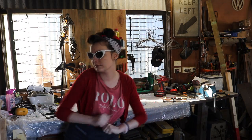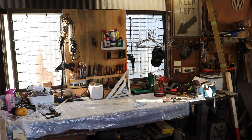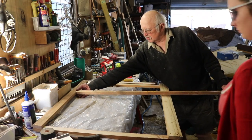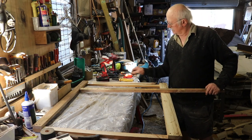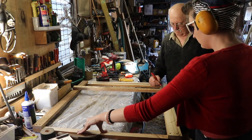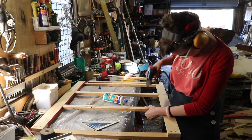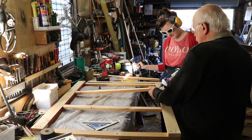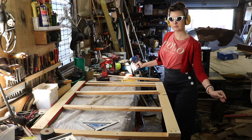I am so helpful in this project — I promise I'm more useful later. Once we had our frames, we had to put in our studs, which are basically ribs to add extra support. As I was planning to sit on the doghouse, I really didn't want it to break under my weight. These were wood glued and then stapled, and we used two studs per side for a total of four studs.